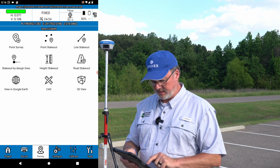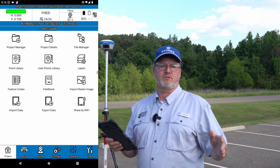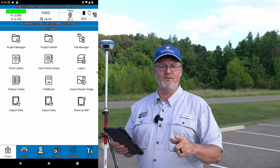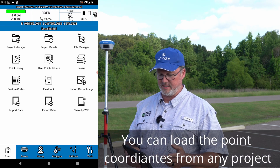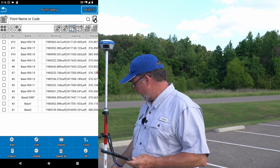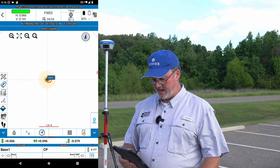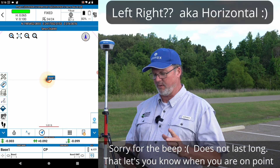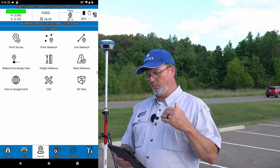I'm going to go to Survey. My project is already open — this is the same project I shot during the L2 Episode 1 and 2 series. You can see at the very top of the screen it says the project name; that's the right one. I'm going to go to Survey, do a point stakeout, and click on Base 1. We hit OK and — there we go — I'm within 3 thousandths, within 8–9 hundredths on left/right. We are correct, so I'm going to assume the coordinates already established.